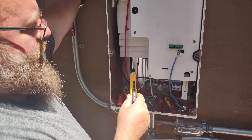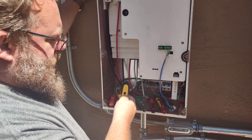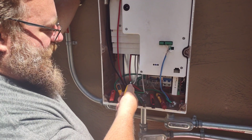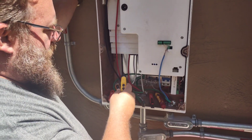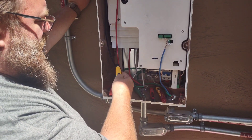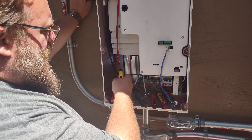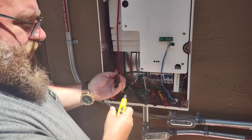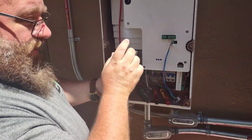This is the Sperry, which is a great company. I like a lot of their tools, but this is not something you want to mess with. This one has a sensitivity adjustment. Now watch: I turn it on and get a nice little white light saying the system's on, but I do not get a green light saying it's safe to use. I'm not able to get any actual tick off the thing — nothing seems to be working right. But if I take my standard detector, those are live wires. What happened? This has an adjustment knob, and while that's a cool idea, in my opinion it's very dangerous.